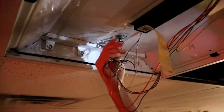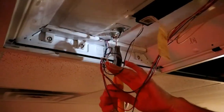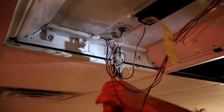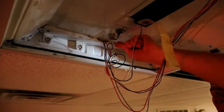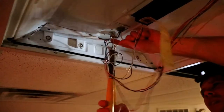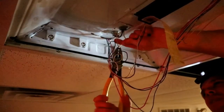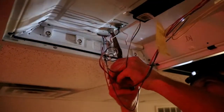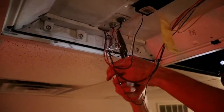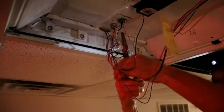We'll remove both wire nuts and then untwist the conductors so they can be pulled out through those knockout holes. It's best if we can methodically unscrew or untwist those wires instead of just ripping them apart. The less you can handle a wire and less you can bend it, the longer it's going to last.